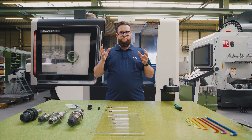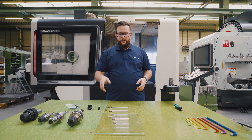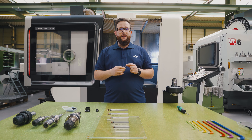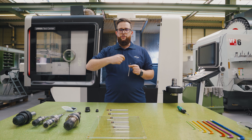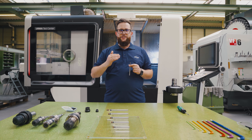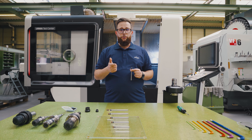This product is meant to reduce your machine downtime to a maximum. This is why the tip is replaceable. This means you set your tool length once and you just change your insert — no swapping the tool in and out, no presetting. Just change the insert and run. Low downtime, lowest cost per bore.